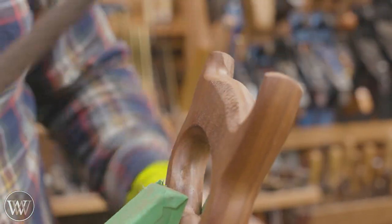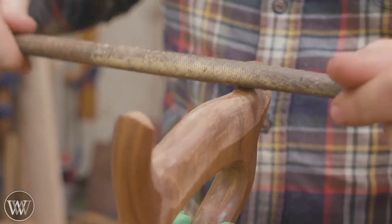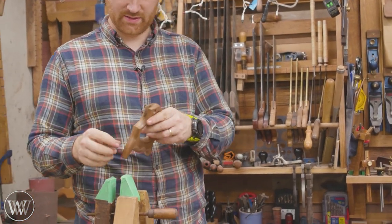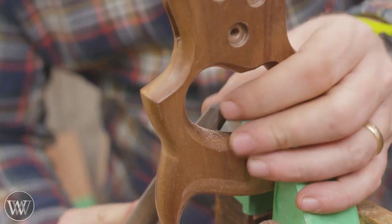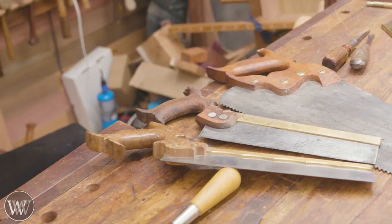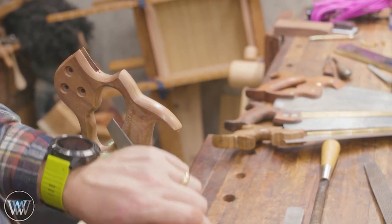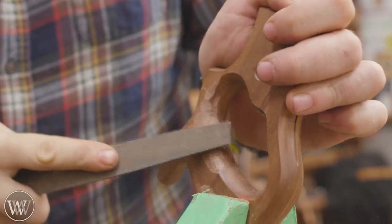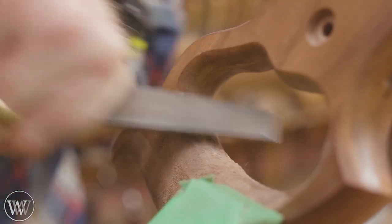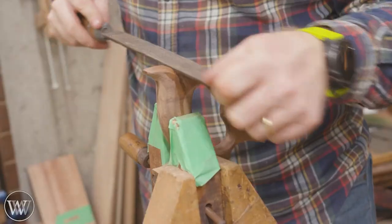Most of this work is going to be done with a series of rasps — rasps take off a lot of material very quickly, shaping it down close to what I want. Then I come in with files to do the detail work and get rid of all the rasp marks. Files have smaller shapes to get into the smaller areas. A four-in-hand allows me to rasp one side and flip around with the file, but it doesn't have all the shapes I need. So I'm using a whole pile of different ones. I have an entire video series on rasps and files — I'll try to leave a link below. Having a whole pile is useful, but you don't need all of them — one good four-in-hand will do most of the work, with a couple finer files for the holes and shapes.